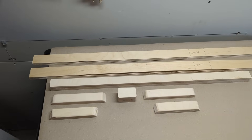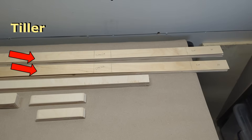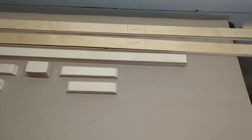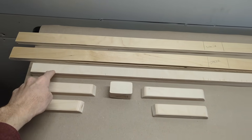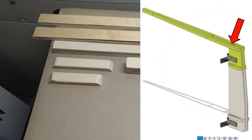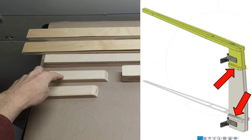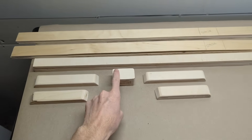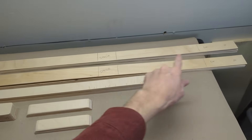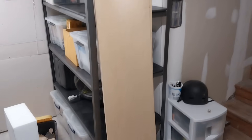Let me show off the pieces I've made already. I picked up some plywood that measured 4.5 millimeters thick — I've got six pieces of that, three for one side of the tiller and three for the other side. Then three pieces of nine millimeter plywood sandwiched together to make the spacer between the two sides of the rudder box. I also call these the stringers for the port side and starboard side of that rudder box. In the center I've got a spacer that'll go between the tiller about a third of the way back from where the rudder ends.